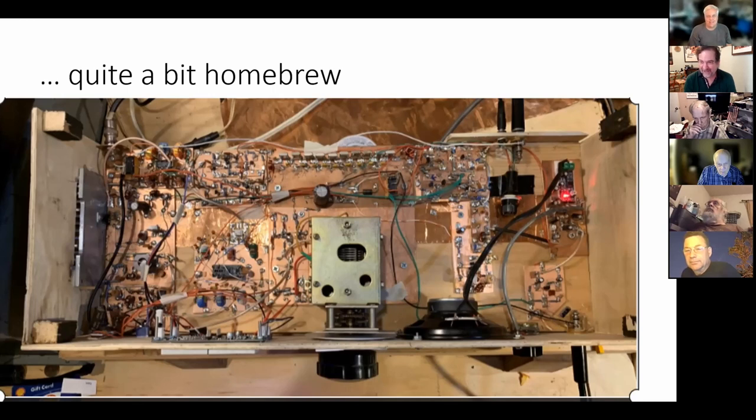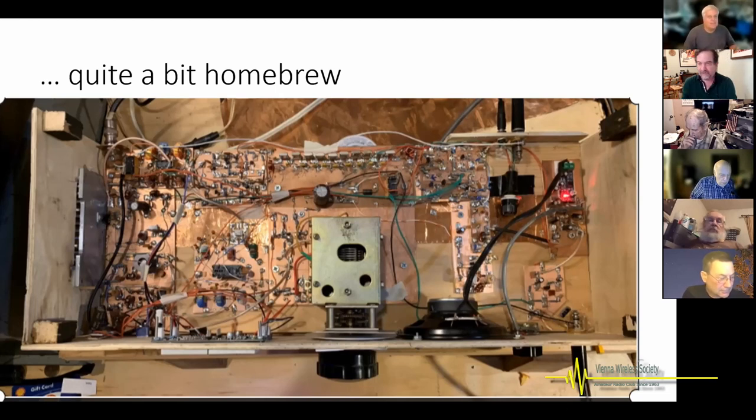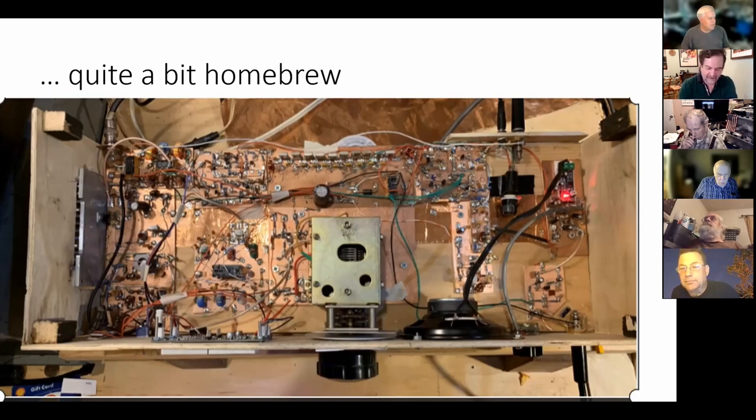Yeah. And I had the same reaction. That's not what I'm talking about. The G3UUR circuit, just check it out. Do a Google search on G3UUR crystal circuit. I mean, look, I have one floating around here. It's just a little board. It's a switch that switches in 30 picofarads, and then you measure the oscillation. Oh, yeah, crystal parameter circuit.